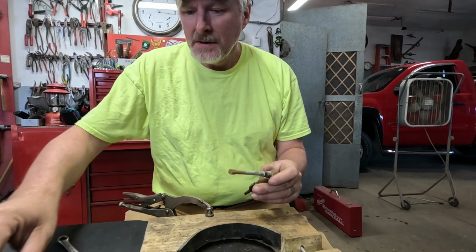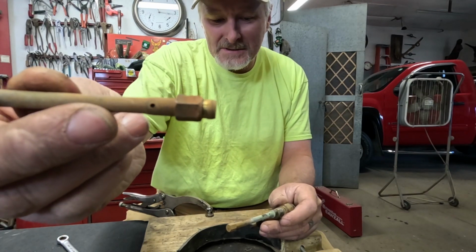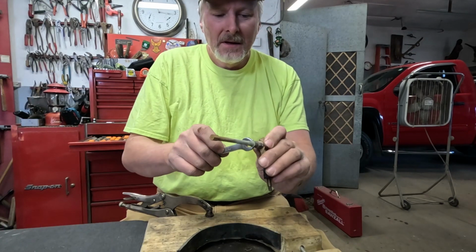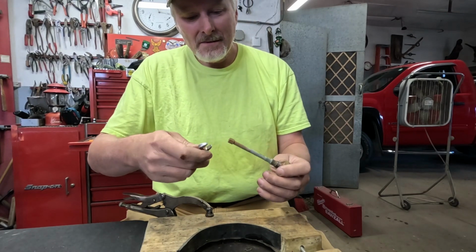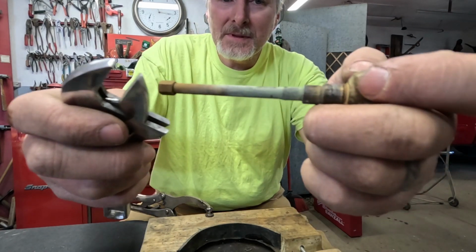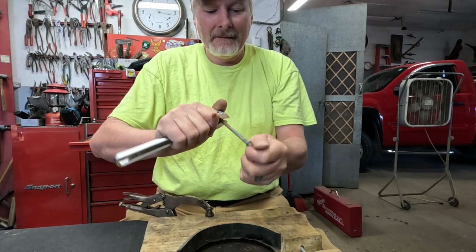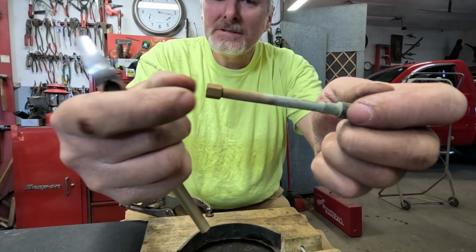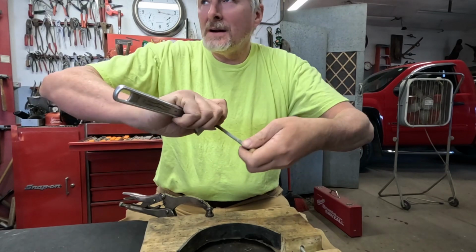That's interesting. The first one tore apart the pickup tube, and they usually do have a 3/8 nut on there you put a wrench on. This one's round. There's no flats on it. I don't know if I can get a smaller wrench down there at the bottom and just turn it from that piece, but it's not worn off. There's just no flats on there to get a wrench on. It still broke loose. I didn't know for sure if that whole thing had to spin out or if just the cap had come off there, but it broke right loose and the whole thing's coming out, so that's not an issue.